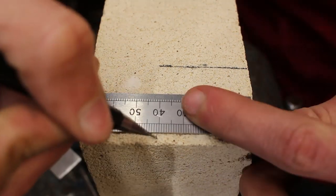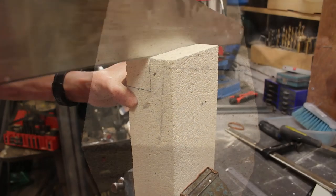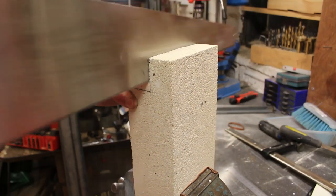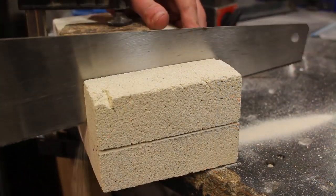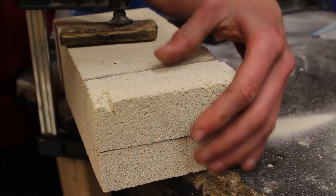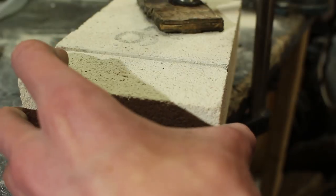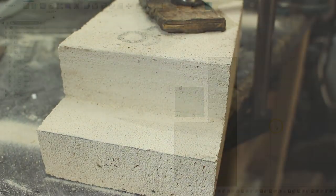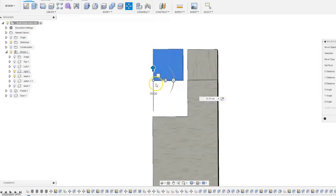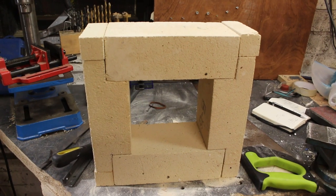You can redesign it and redistribute the bricks in a lot of different ways to get different shaped cavities on the inside. Once I'd got all my bricks together it was time to start cutting them - these bricks are really soft and can just be cut with normal woodworking tools. I marked out a 40 by 40 millimeter square in the corner of one of the bricks which I needed to cut out. Cutting these bricks produces a really fine dust so you should definitely use a dust mask and some sort of extraction, and clean up all of the dust afterwards since silicate dust would be really bad for your lungs.